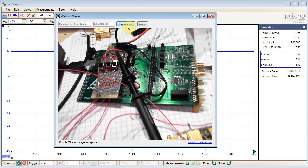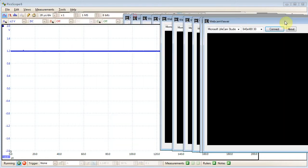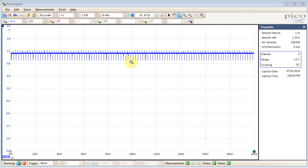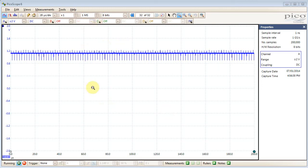Let me turn this off. What I'm going to be monitoring is just the 1.2 volt supply on the PicoScope probe here. Here's your typical setup that you might have with any scope. The first thing I'm going to do is just look at how the signal looks. We're at 1.2 volts, then I turn on the load and see what happens. We're actually seeing some pretty bad responses here — these huge negative spikes going down much more than we'd like.